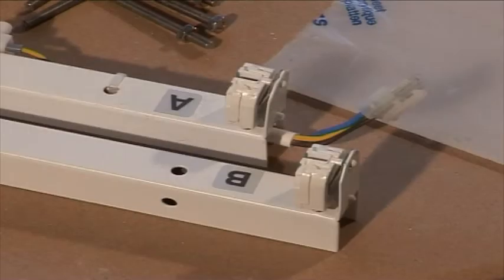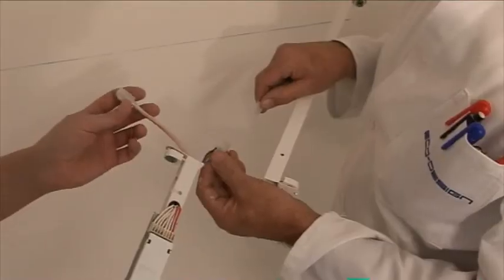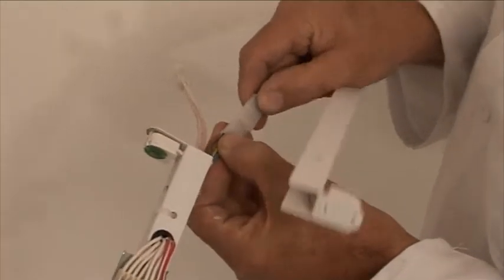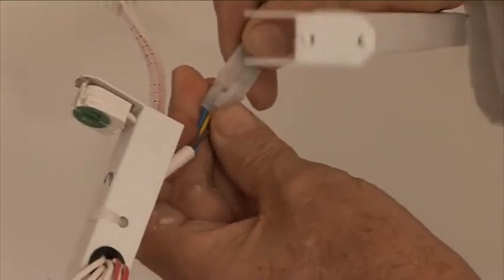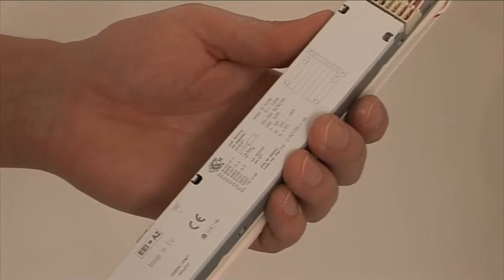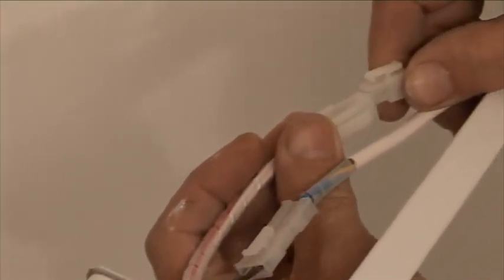The type, number and watt output of the equipment must be stated in every project. Select direct and indirect lighting equipment and always start with the direct one. Start with that part which is fitted with the input wiring box. The equipment parts can be overlapped so there are no dark shadows between the lamps.